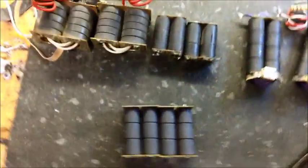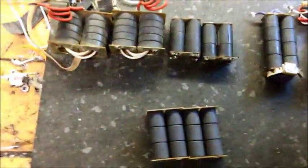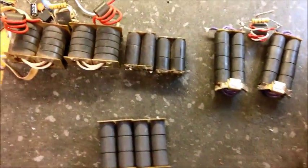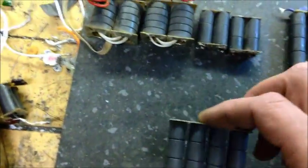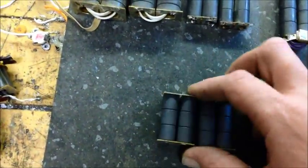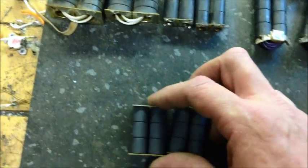Add-on to this video — pretty much what I'm going to do is change out the output transformers and maybe do a little bit of tuning. Once I got all that done, we'll throw it on the video and I'll let you see what my reports are. Basically we're starting with these — some inch and a half, half-inch diameter transformers, which are usually what I use the most in most of my amps for the standard street box. They're inch and a half in there right now.